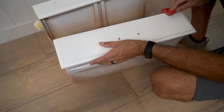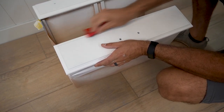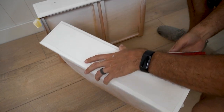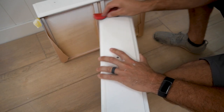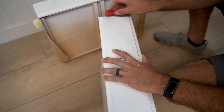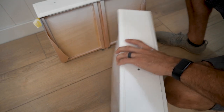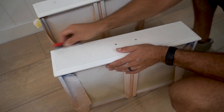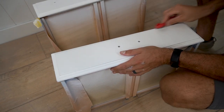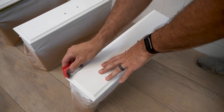One thing that I left out that I want to quickly add on the sanding in between primer coats: you could definitely just use a fine pad, which is like 180 to 220, or maybe even very fine from Surf Prep, on the flat surfaces as well as the curved surfaces, and probably be okay. You just want to sand back the primer to where it's smooth and nice and flat, and you don't really have any orange peel in it. That's really the only aim that you have.